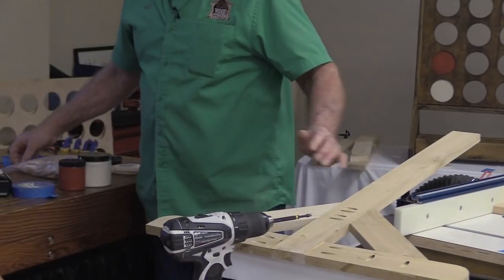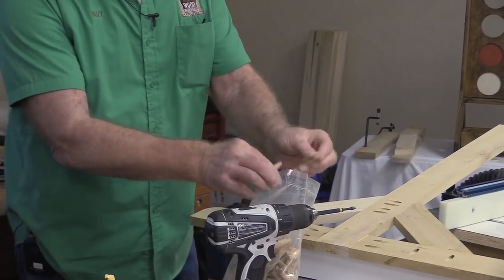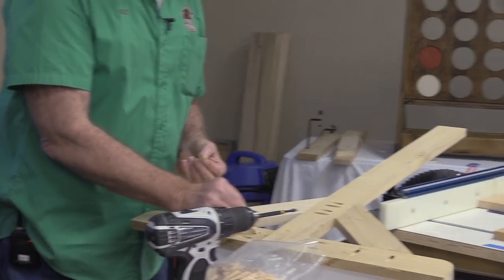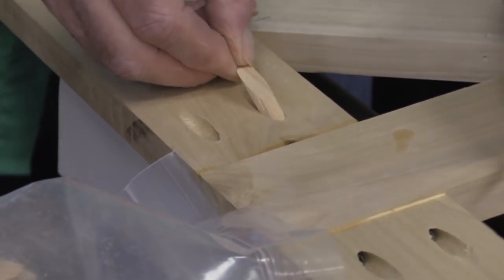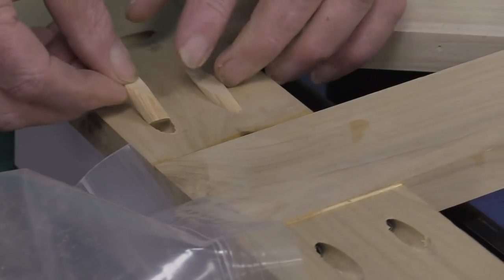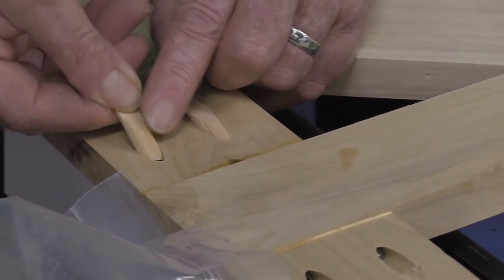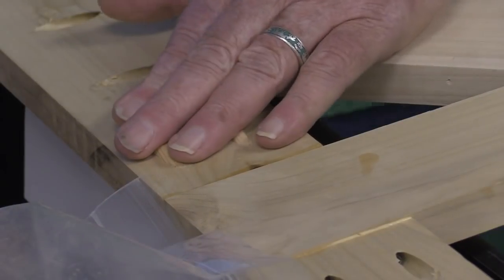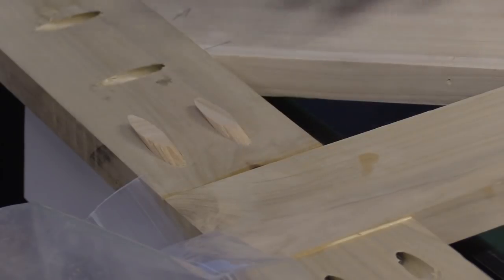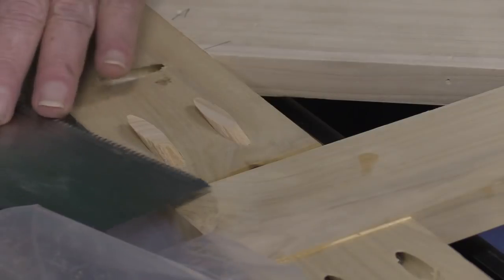And then because we're professional, we put these things in it so it wouldn't look funky. These aren't poplar ones. I was happy with them. I'm sure some of you have used the Kreg thing. You glue them in, the exposed holes, and I'm not going to do it today because I'm not going to round it over. But you glue them in. Sometimes you got to tap them with a hammer a little bit. And then when they're dry, you come in with this thing and flush them off. Ain't nothing but a deal.